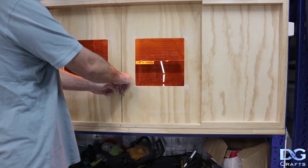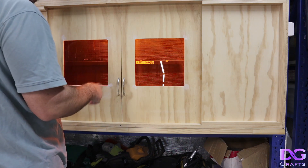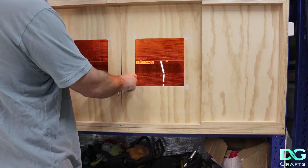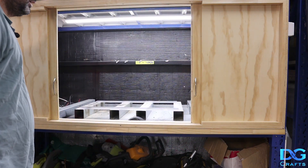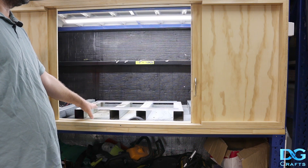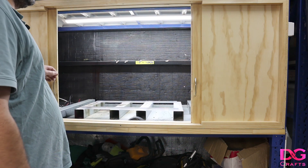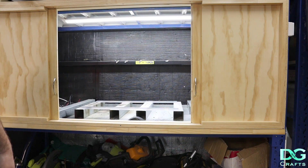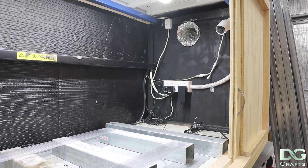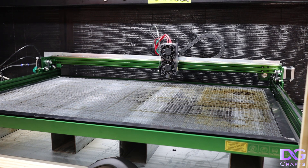This is the enclosure I've built for my Max 3. You can buy laser-protective panels on AliExpress rated for the 450-nanometer wavelength. In there the laser sits on raised beds so I can drop them out and put a rotary axis in the bottom. I sealed it — it's just a normal shelving unit in a shed — and it has an extraction unit to the outside. You can see the extraction unit in there that sucks the air out. Something worth thinking about before just going and cutting.